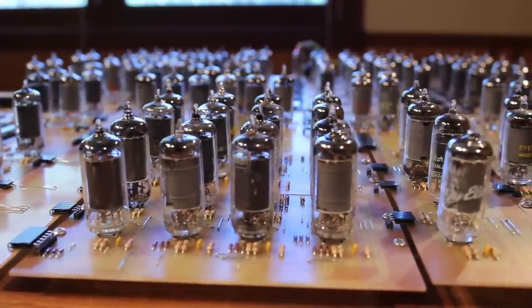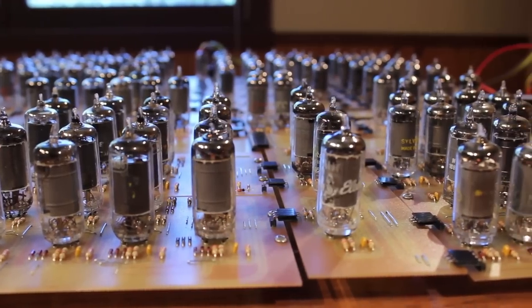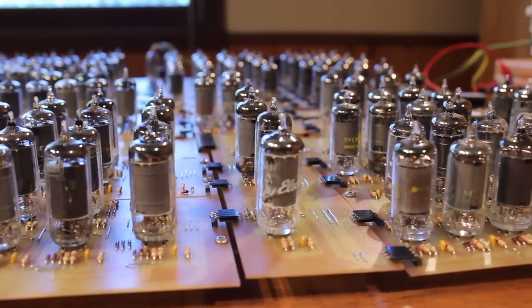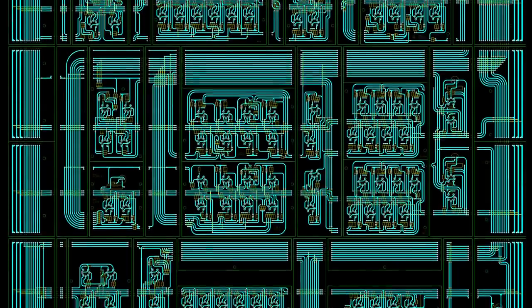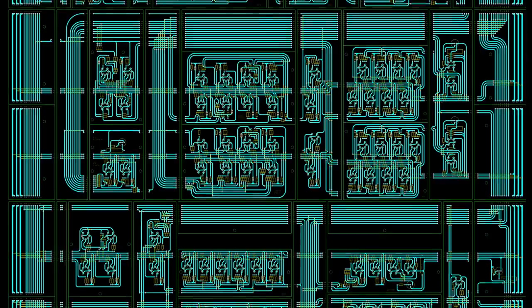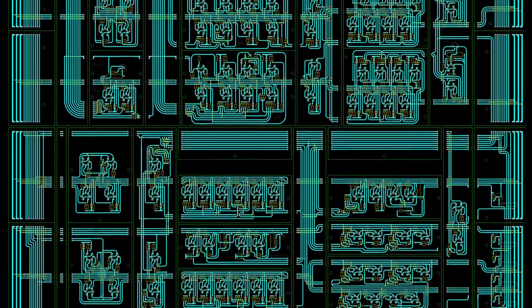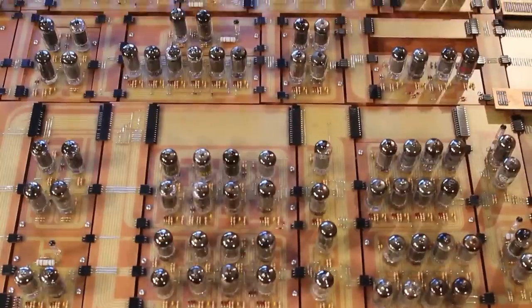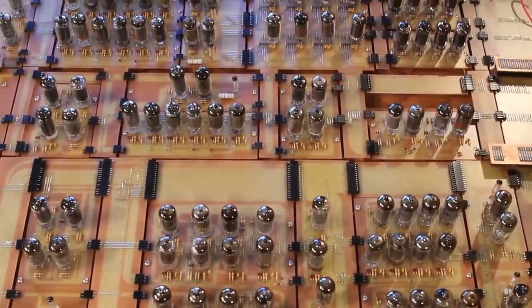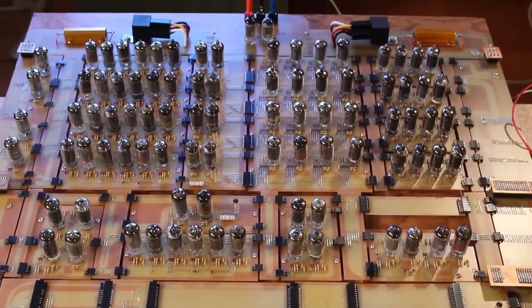We are able to clock in instructions, we're able to modify data and get outputs from that. This is pretty much a vacuum tube computer at this point. Now we're still missing some important parts. Below this here, we still have to build the output enable register as well as the multiplexer so that we can put data back onto the bus and do some more interesting control with it. And also you notice that we had to write down all of the answers because there's no memory on this computer and memory is difficult.